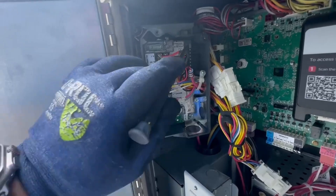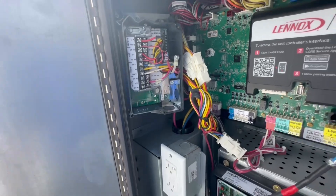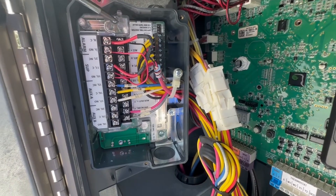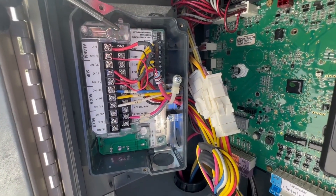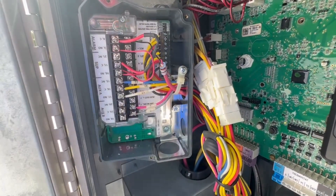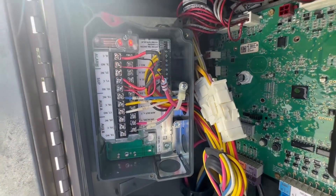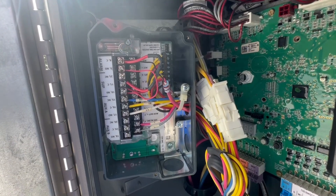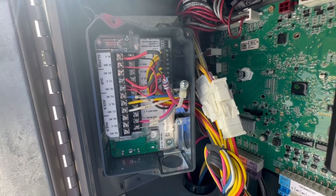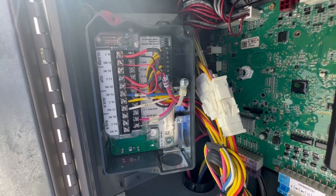What I've found is you can go in here and change that dip switch to two, then turn the power back on. With switching that dip switch to two, it's going to go back into a trouble. Usually I just do this and let it go through its process, then switch it back — sometimes something happens with that dip switch and it tries to read the second sensor. This is a way I've found to fix that, and then it's going to flash like that because it can't sense that sensor.